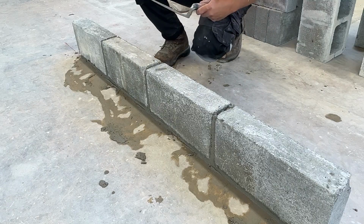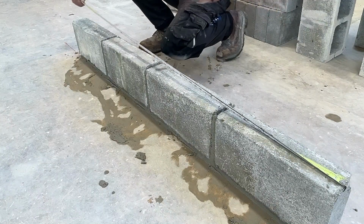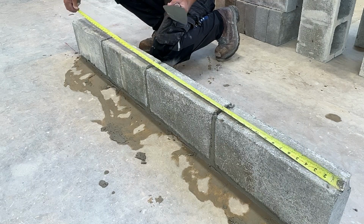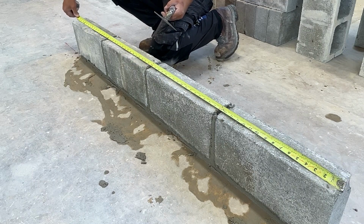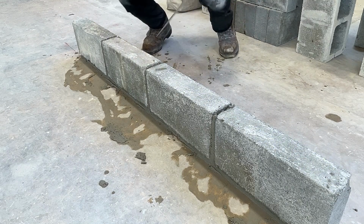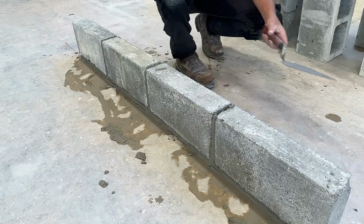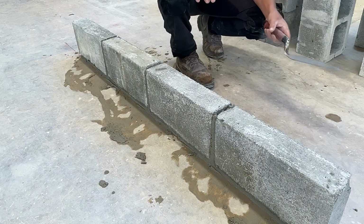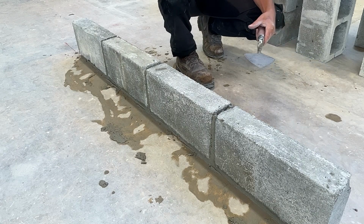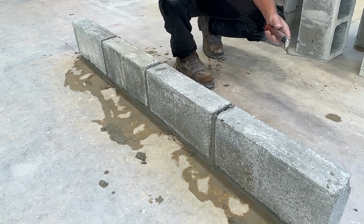Before we start spreading mortar for the next course, we can double check our overall measurement. You sort of don't have to if you stick with the pencil lines that you originally drew. We should be at exactly 63 5/8, and we are. It's more important to check on the subsequent courses with our tape measure, our overall length, our overall bond. Since we had the marks already drawn on the floor, not too important to check, as long as you stick with your bond marks.